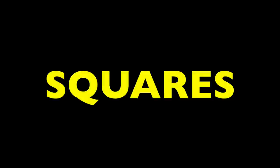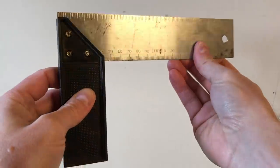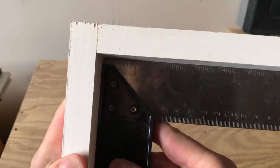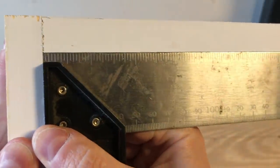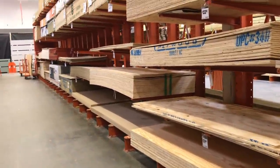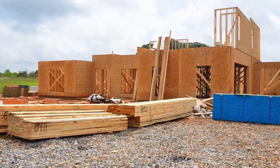This concept is so fundamental that we refer to the tools that determine squareness as squares. We've got the classic speed square, the much larger framing square, the fixed blade tri-square, and the combination square. We slide these tools into corners to test for square. Visible gaps prove that structures are out of square, which just screws things up in carpentry — we correct this before continuing to build. Nearly all of our building materials are designed around square angles. Rectangular sheets of plywood have square factory corners, siding boards have square ends, and even 2x4s are expected to be square. We're obsessed with square in construction, because when you start building something square, it's much more likely to remain square as you go along.